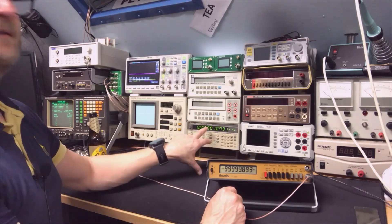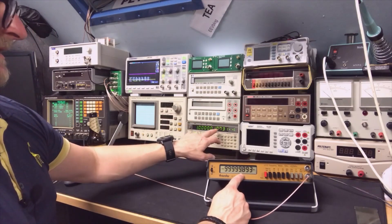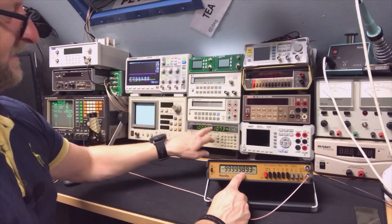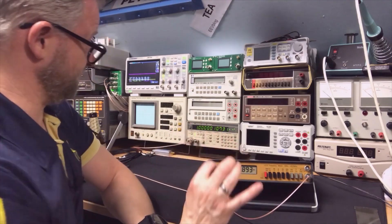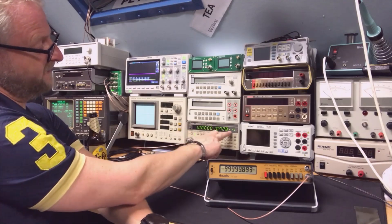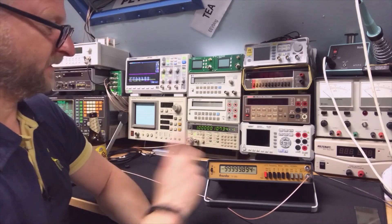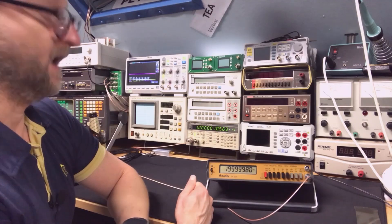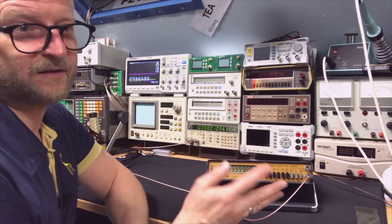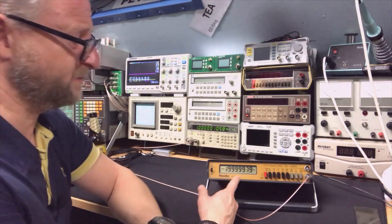It is indeed a little bit off. You can see exactly 107 units difference here, and on the other side 893 — that's exactly the 107 that's missing, so the math checks out. Even though the oscilloscope said 1.000000, the oscilloscope loses the last digits. Let's now put it to 200MHz — it does work up to 200MHz. Sensitivity is good because 50 millivolts is nothing. The machine is good.